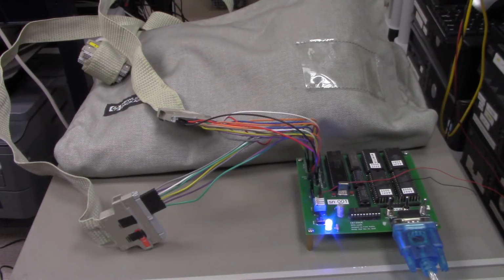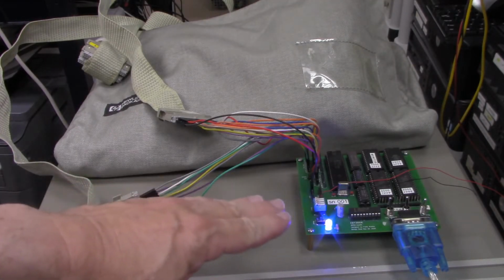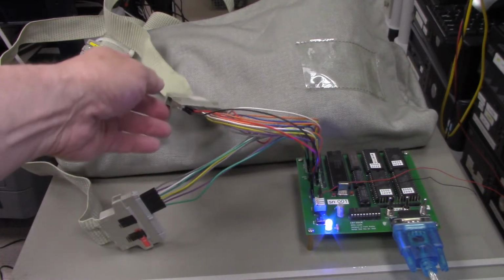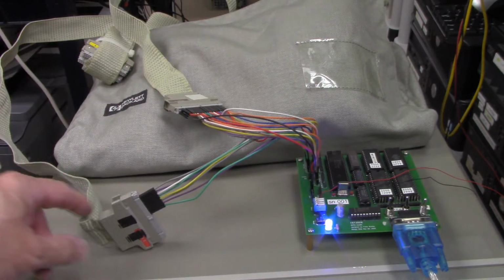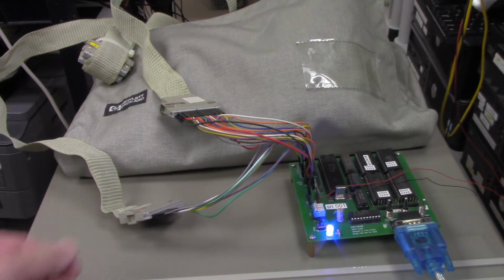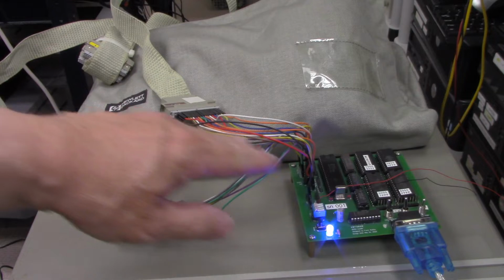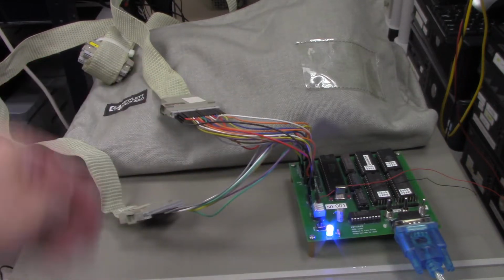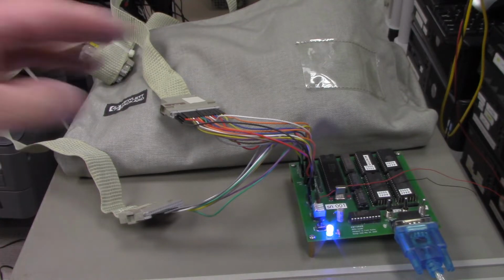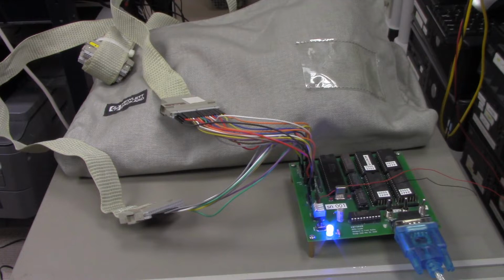So this is the top of the Logic Analyzer where I have my 8031 microcontroller that I'm going to analyze today, and pod 1 is connected to the address bus and pod 2 is connected to the data bus. So we're going to run a little program on this microcontroller and try to read it in the Logic Analyzer to see if it matches the code listing. So we can see the sequence of the instructions as the program runs, which is a good way to troubleshoot if you have an issue with the software or hardware of your microcontroller or microprocessor.